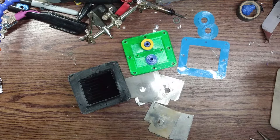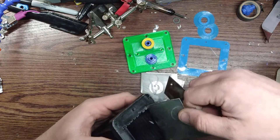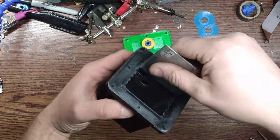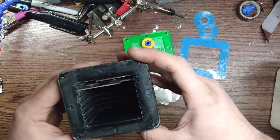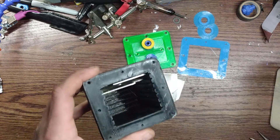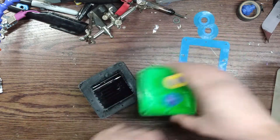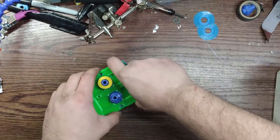For anyone who doesn't know how an electrolysis machine works, it's pretty simple. I've got a bunch of plates here, and they're going to sit in these grooves with about a four to five millimeter gap between them. They will be wired positive and negative — positive, negative, positive, negative all the way to the end. Once the plates are in, they will be wired up to the two terminals in here.